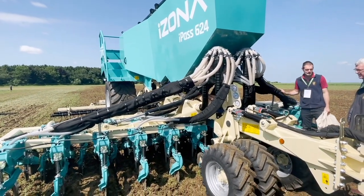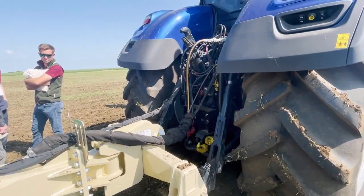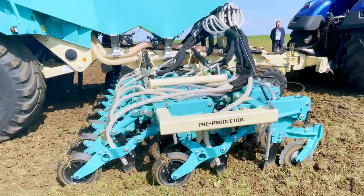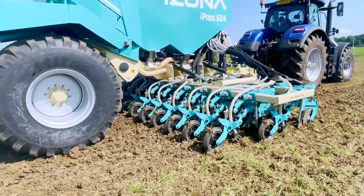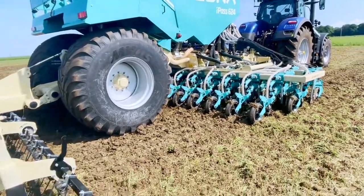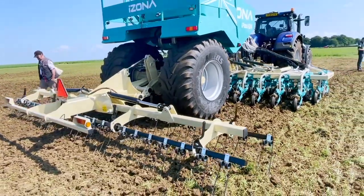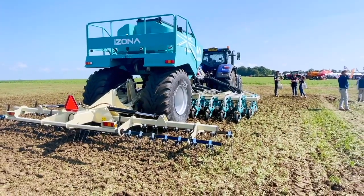The concept of this drill is we're looking for a drill that is a high output drill, very simple to use, and we aim at the larger farmers with more horsepower, let's say 300 plus tractors, where they just want to get on. The tank is 7,000 litres. That's putting enough seed and fertiliser to do what, 16, 20 acres, depending on the seed rate. The rear axle is an 18 ton rear axle, all over air braking, safe, legal, with a following harrow that covers the seed.